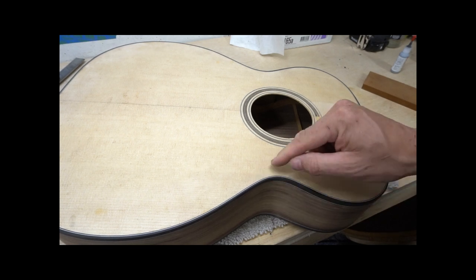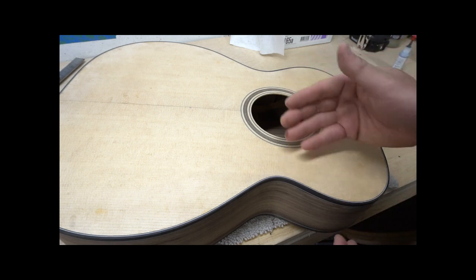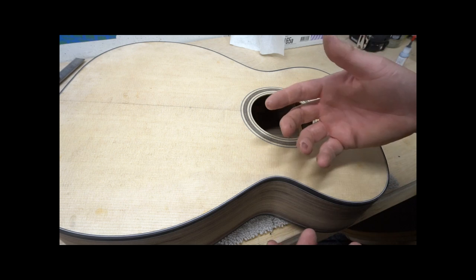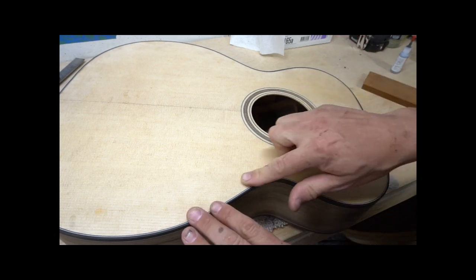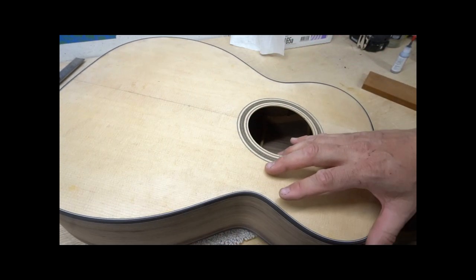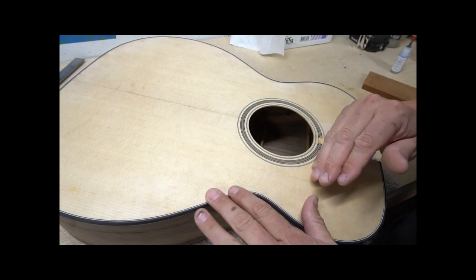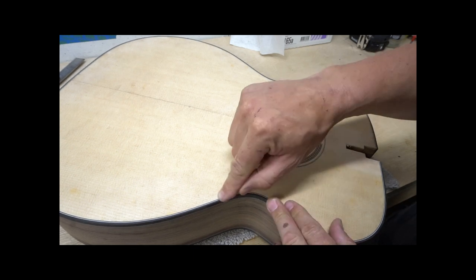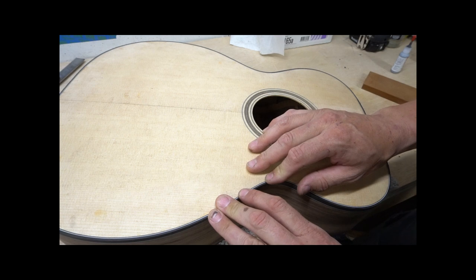One thing that I found helpful, if you need to super glue fill near spruce, is to use a spray shellac or use like a 1 pound cut if you have that around. Let it completely dry and then fill with the super glue. I say super glue, really it's CA or cyanoacrylate. Super glue is just a brand name, the generic name that I use. Probably shouldn't do that. I'll just call it CA from now on. If you want to use that CA, seal it with shellac, then drop it. There are some colored CAs.